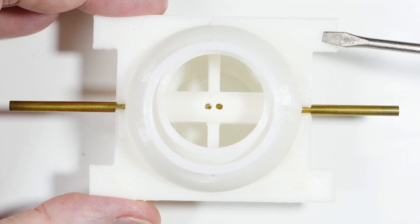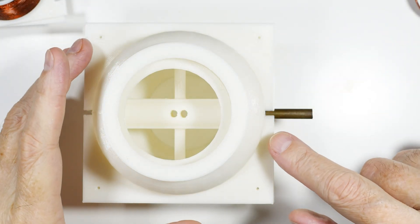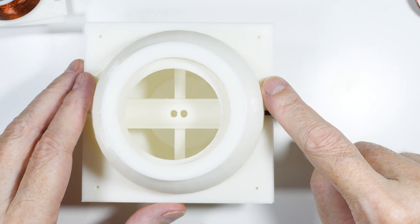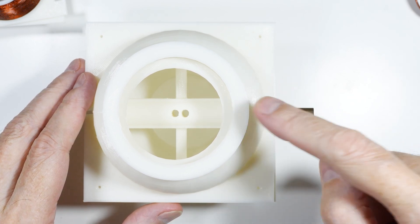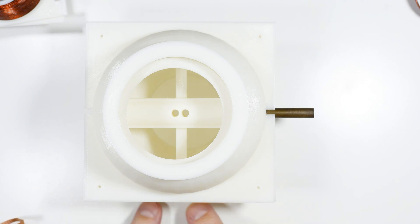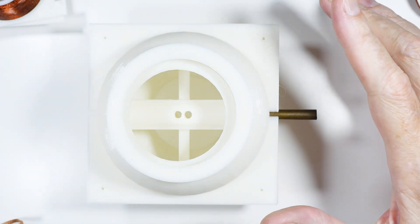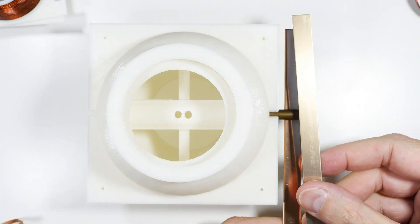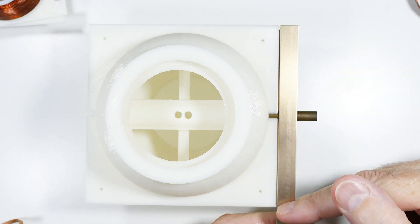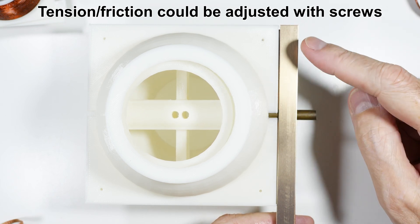Let me shift to the bigger model to show you more easily. The variometer I'm copying transfers electricity through the shaft to the inside coil, which comes out the back side and goes to the bottom of the outside shell coil. The model I'm working from used two strips of metal like this — and now you can see what those tabs are for. They hold the strips in place, and the strips act like a spring to transfer electricity.